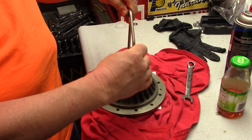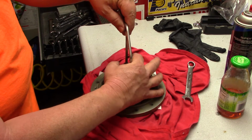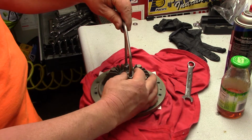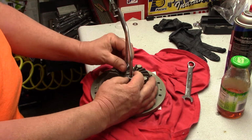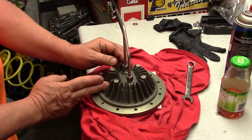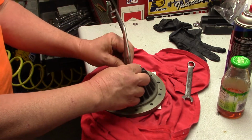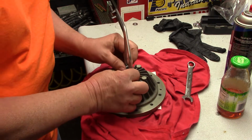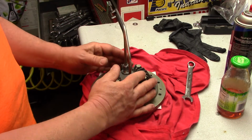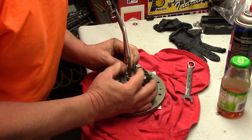Okay. So here we go, we thread these on here, get these AN fittings started, and it should hopefully be self-aligning. This basically has to be to the 9 o'clock position. This would be the top of the engine, or 12 o'clock index, so we're looking at the back, but to the left would be to the 9 o'clock position, 90 degrees, so we want to be sure that these are straight. Aligned, because if not, they'll be in a bind trying to install them, and we want them just right. It looks like they're pretty self-aligning.